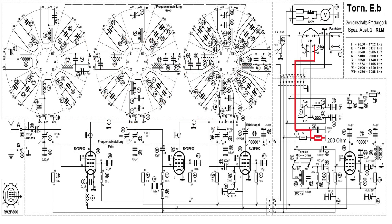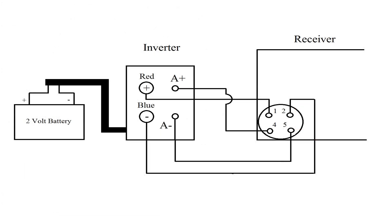That's very important because they use the negative side of the high voltage supply through a 200-ohm resistor to ground in the radio to develop the bias voltage for the radio. So you do not hook the B minus directly to ground.